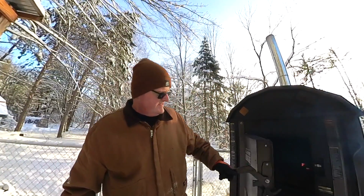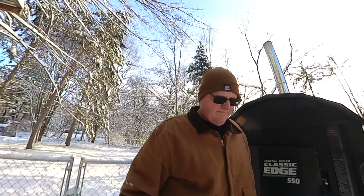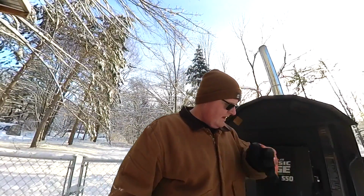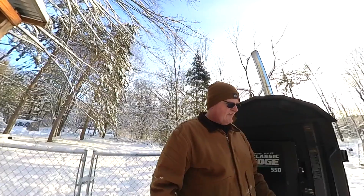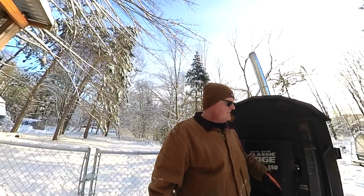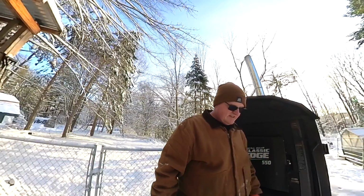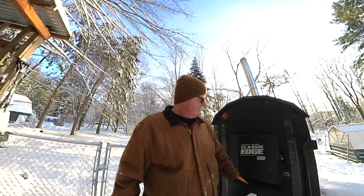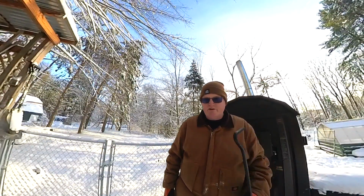Since I'm not going to be gone all day, I didn't fill this up super high, because I will be here. I'll probably come out here again, sometime early afternoon, to throw some more in. That's one thing: if you fill these way high up, you've got more moisture that's going to try to come out at once, and in this weather that can contribute to building up that creosote plug in the primary. So again, stuff we want to avoid, because this isn't fun, and you don't want to do it every day.